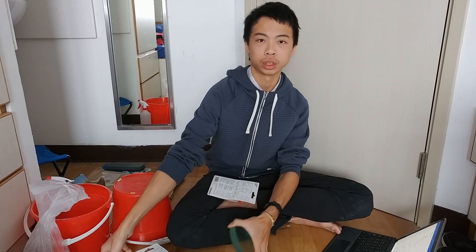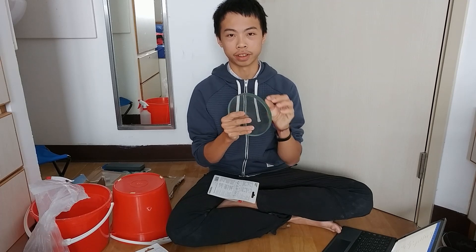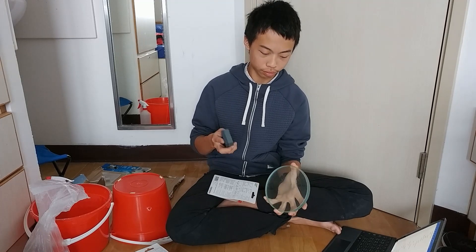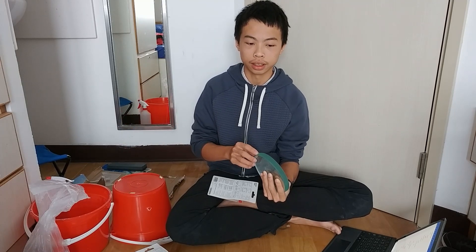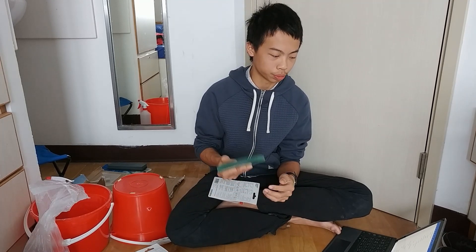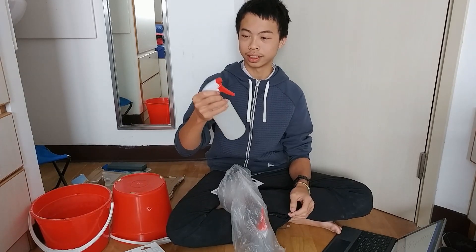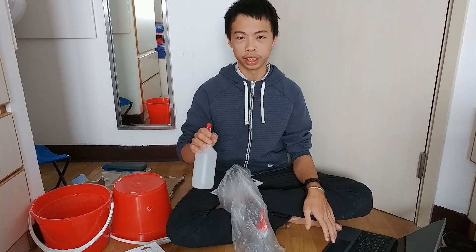The next thing I did yesterday was making the bevel on the edge of the glass. You want to do this because having a sharp edge makes the glass chip really easily. I made the bevel with a knife polishing tool and just ground it. On stellaphane.org they said the bevel should be around three millimeters, but mine is only around two millimeters — I think it should be okay for a small mirror. The most important supply is probably your grit. I also got a spray bottle to keep your tool and glass wet at all times to prevent dust from flying.